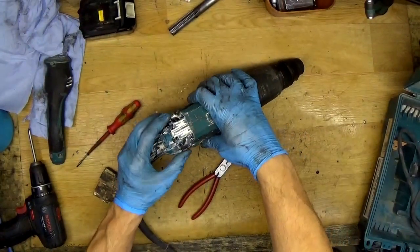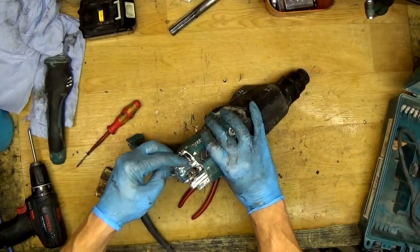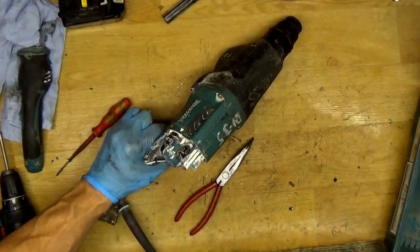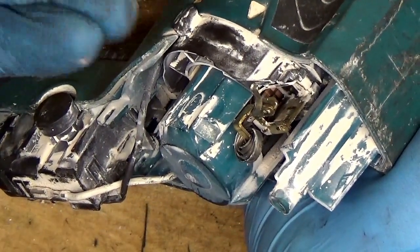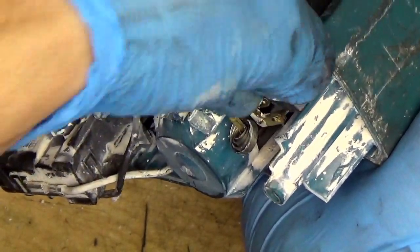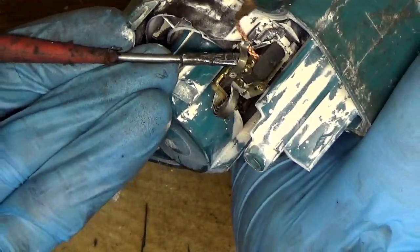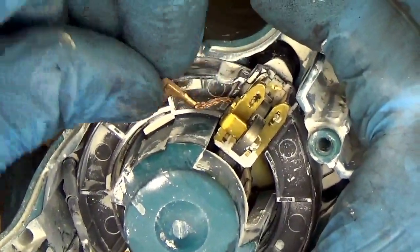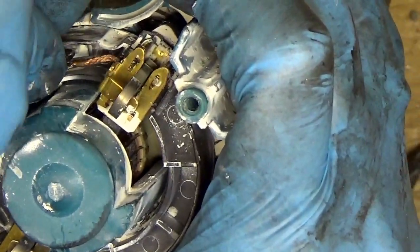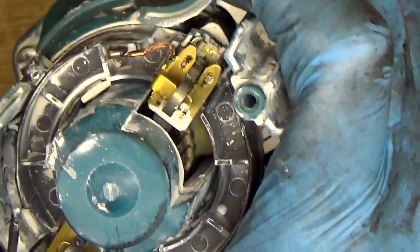So okay, now the second brush, just getting the carbon brush holder unit here. We can see the gap here for the carbon brush. Okay, zooming in a little bit. So now checking the wire, getting the carbon brush in, pressing it in. The wire goes here in the gap, so lifting the spring. As you can see, the spring is on the carbon brush. Now just connecting the carbon brush. Okay, you can do that with a finger for this one. Of course, press it with a screwdriver or with pliers down to make a good connection.